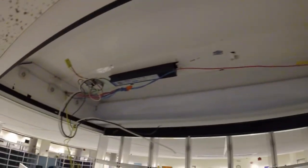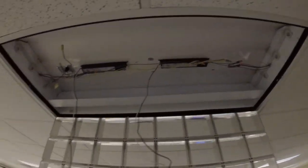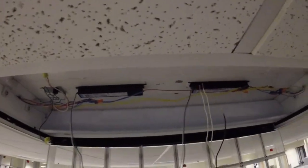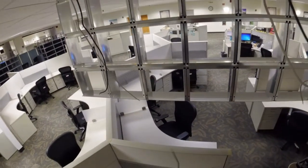Alright, so that's one completely hooked up except for the power. I'm going to do the other one and then come back and do the power side. Alright guys, so I've got the other one installed. I try to do all my stuff as neat as possible. You'll notice that they are sharing a neutral on one of these instead of jumping it out. So when I disconnected them, the red and the white were hooked to the second ballast because that's controlled by one switch; the black was hooked to this ballast — they share a neutral. So we're going to put that back, put our rubber gloves on again, reconnect them, hook everything back up, put some lamps in it, and get it working.